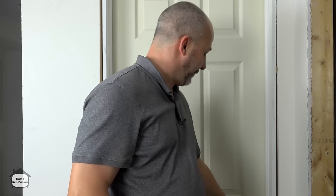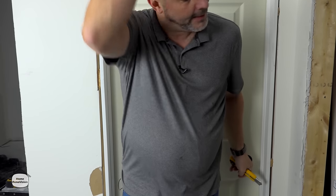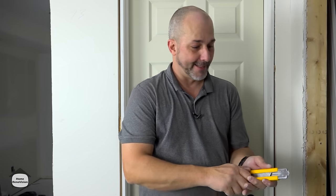Now that's the strongest door system. And the reason we call it the strongest is because we are using construction screws. Look at that. That's a nice gap. I got 3 of them on each side. And that gives me 500 pounds of shear strength. So when this door is closed, it's going to take a whole lot of energy to kick that sucker in. Which really shouldn't be your first goal in a basement. But if you like to build things that stay put, that's a great way to do it.